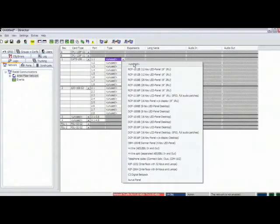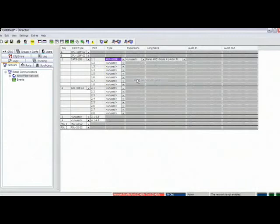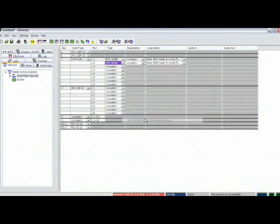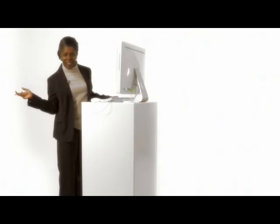Now, from the pull-down menu, select the panel type connected to the port. For the Cat5 port 1.1, we connected an RCP1028. On the second port, we have a DCP1016 connected, and on the analog client card, we have a 4-wire on port 2.1. Done. Now do the same with the second frame and the second DCP next to the red box.